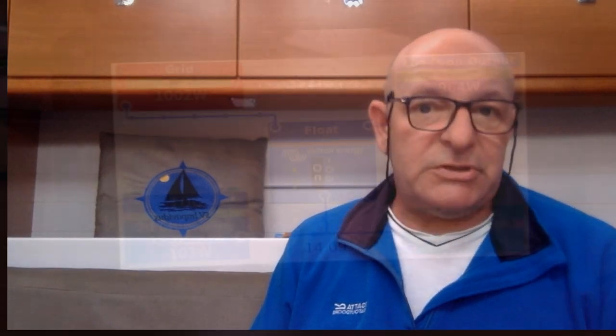When we're plugged into the mains via the shore power, it takes the shore power and turns that into 12 volts at 60 amps to charge our lithium. It also bypasses the charger and allows things like our water heater and other 240 volt systems like our freezer to run directly from 230 volts, which is more efficient.